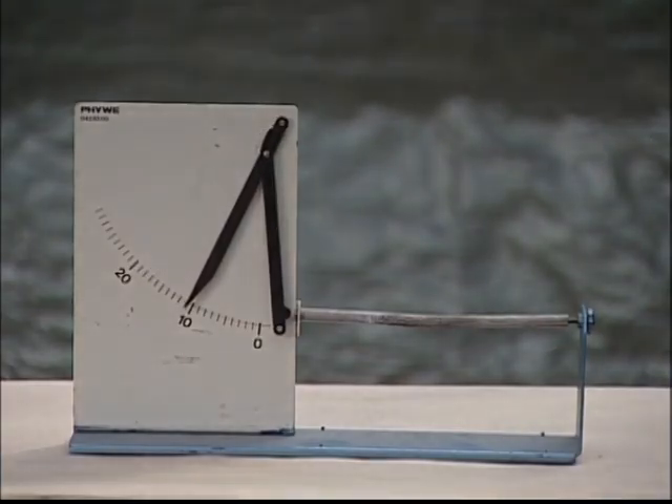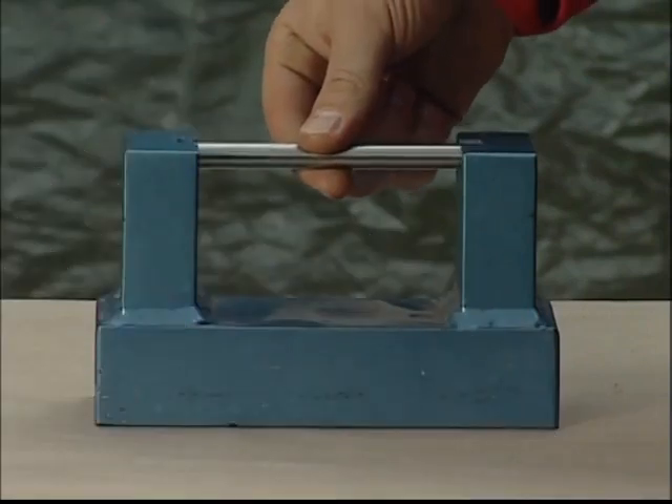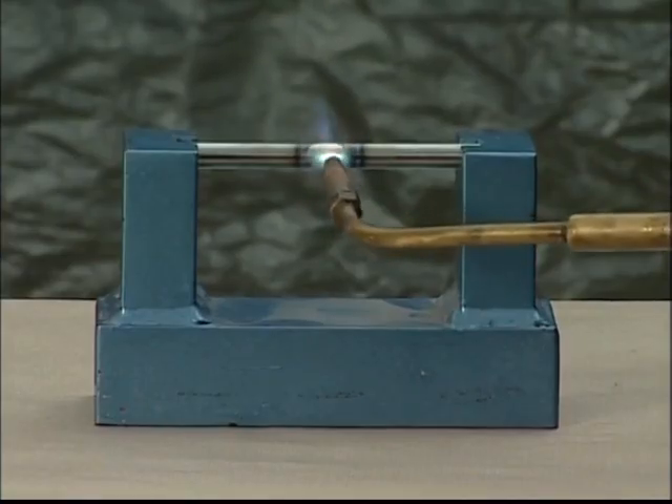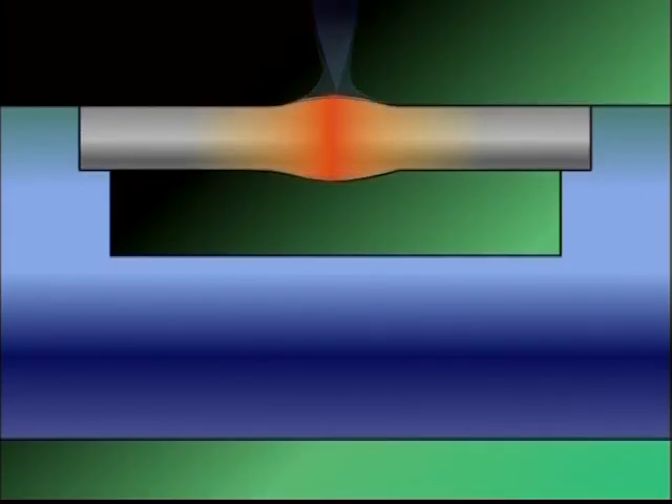Notice we have not altered the rod shape. But suppose we place a metal rod in a fixture strong enough to prevent any increase in length — what happens then? The heated material wants to expand lengthwise, but the fixture hinders this. The material is therefore forced to expand in a different direction, away from the rod. It now undergoes what we call a plastic deformation. This deformation is permanent and cannot be reversed. As the material cools and contracts, this time it results in a shorter rod.